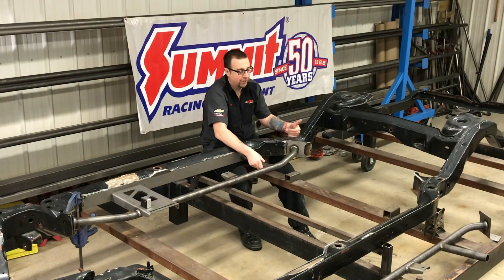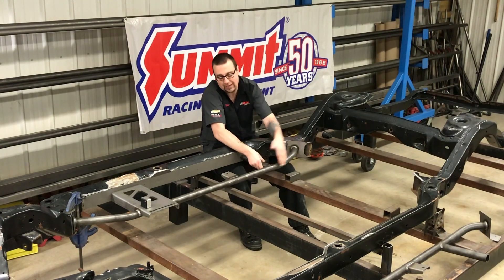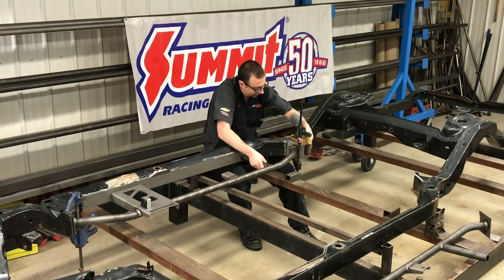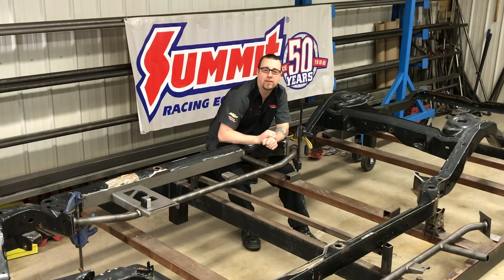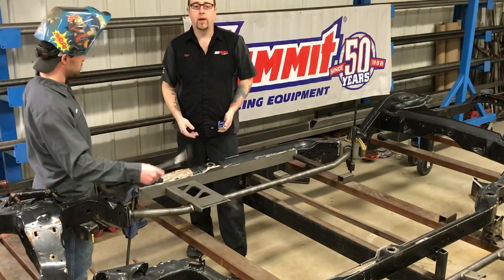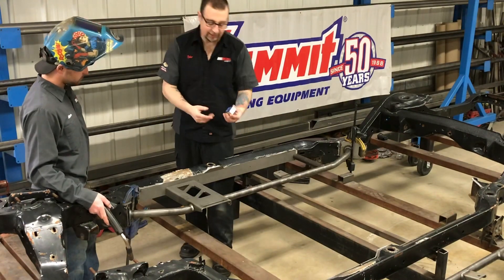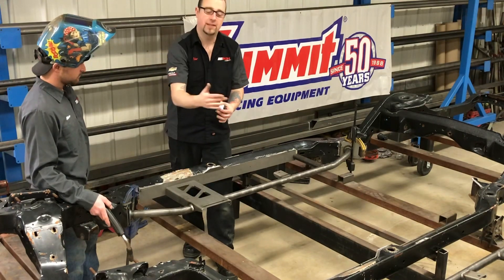There are some differences in frames and a little bit of tolerance allowed, so you're not compromising the control arm mount because we're actually boxing that in with thicker metal and welding it on three sides, as well as tying it into the frame itself. Once I like the way this is fitting, I'm going to clamp this in place so we can check our levels and start tacking this assembly in. We're going to check the level of this transmission mount and make sure it reads zero side to side.